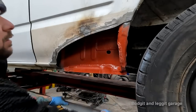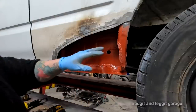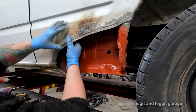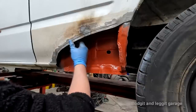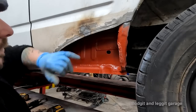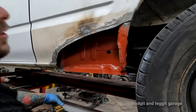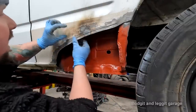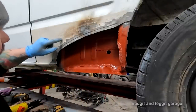It will also get rid of this twisted metal here because I know what's happened. There's been welding and stuff done here before. There's a lot of material here with no structure. This is strong here, close to there. And of course, with me putting that joggle in, I've made it a little bit worse, and I've kind of stretched and warped the panel. But I've got enough panel here to cut that out, get most of that out of the way. It's a lot stronger here than it is down here, and we're going to be fine. So I'm going to now cut this mark that I've made.